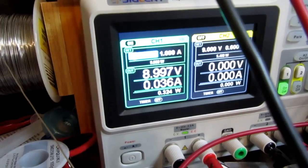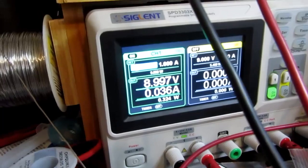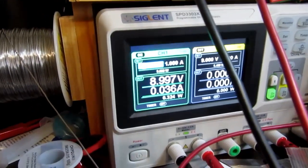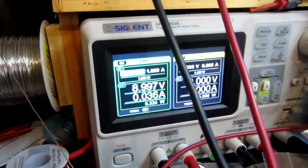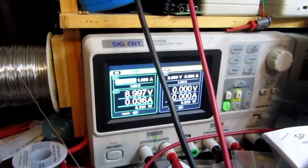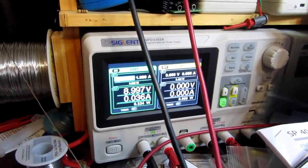And I probably should do some sort of calculation to see if the 9-volt batteries I've got powering the 741 op-amp circuit can run a couple of these. So let's say it's 40, say it's 80 milliamps. How much life can I expect to get out of a 9-volt battery at 80 milliamps?